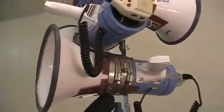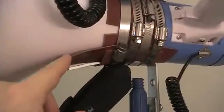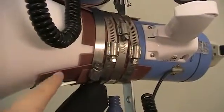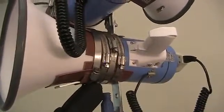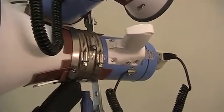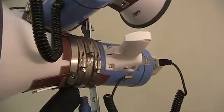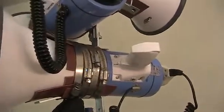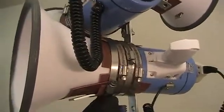Now I'm going to explain some of the parts, with more details. So for example, this rubber here. I use 2 different thicknesses depending on the main purpose. I used the thicker sheet, which is 1/8 of an inch. I got it from Lowe's in the plumbing department, and it provides cushion such that the megaphone doesn't crack under the pressure of the metal bands. Okay, I didn't want my megaphone wrecked.